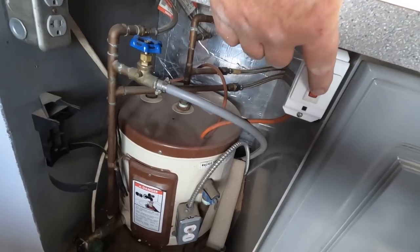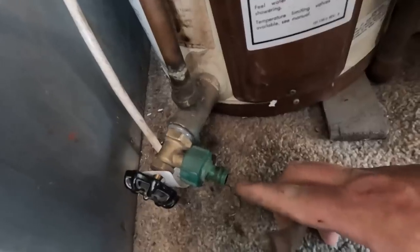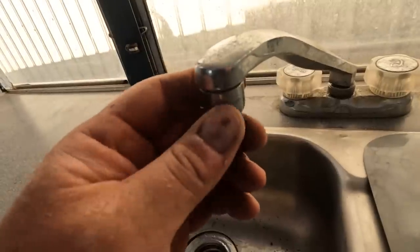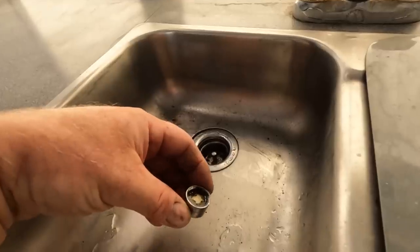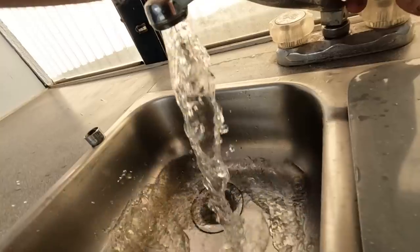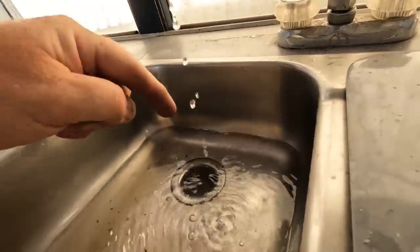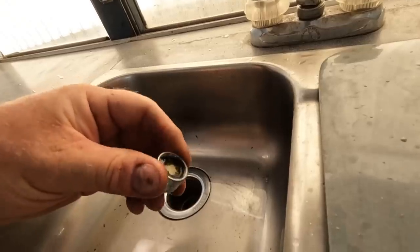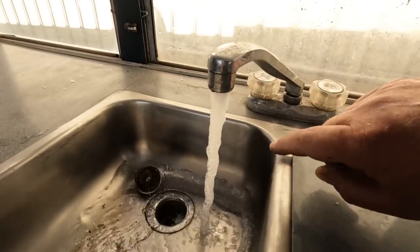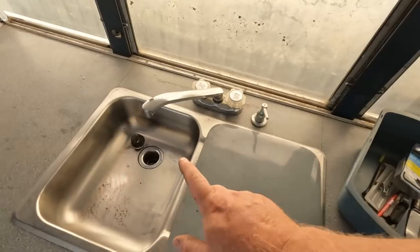Now I'll turn the water pump on, open the input valve here, and the valve is closed. We're under pressure. No water coming out. Still getting nothing, so we're going to check this one out. There's a bunch of junk in that. Let's see how it works without this. Now we've got water, so we've got to clean this thing next. That's what I want to see — we've got a working sink.